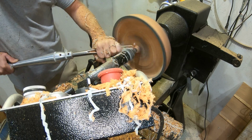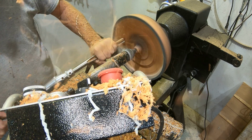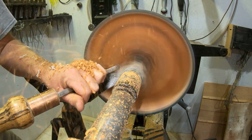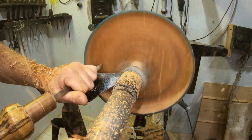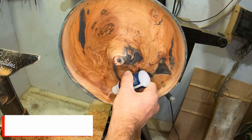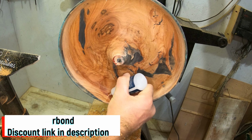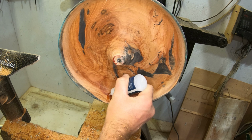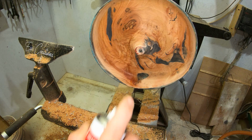Yeah, right now I'm using my big Carter & Sons 3/4 inch bowl gouge. When doing epoxy, it's hard to really remove a lot of material at one time without it, what I call, detonating, because when it shatters, it sends tons and tons of shards everywhere and makes you bleed a lot of the times. And sometimes, you know, that bowl gouge ain't too bad doing that. Just hog out a bunch of material faster than you can with the carbide.